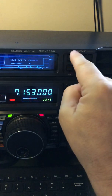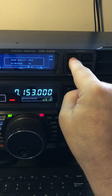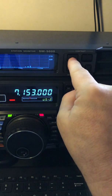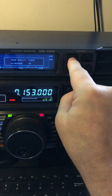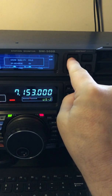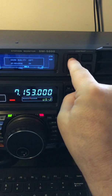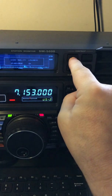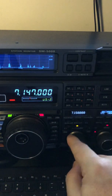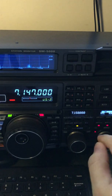Now I'm going to go from soft to loudness. Catch it when he's transmitting again. You can hear it — hopefully it's translating through the phone. What loudness is doing is adding fullness by boosting lows and highs. Here's normal or clear, mild — tapering a little bit of highs off — soft, taking even more highs off, and then loudness. I'm going to get some kind of strange heterodyne here, somewhere around 920 hertz. Thank you, manual notch.